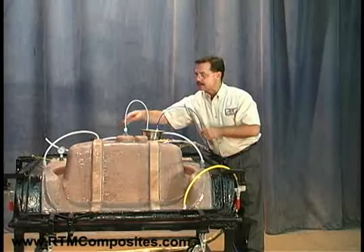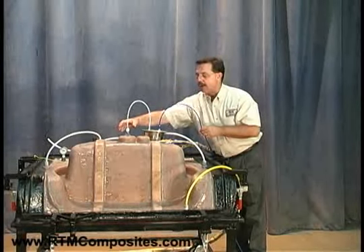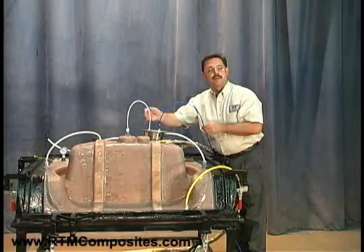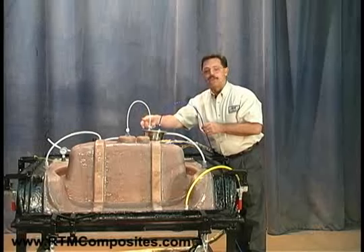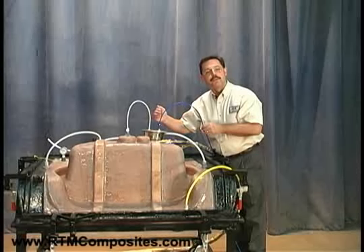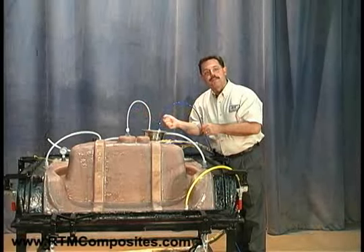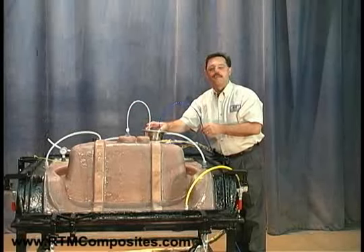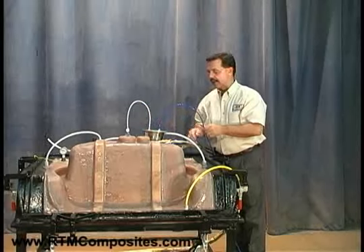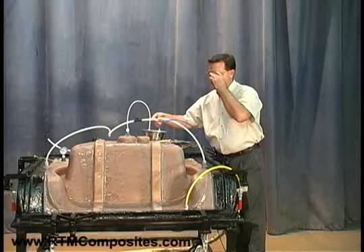Our catch pot will witness resin coming through the vent — this is the end point of the fill, the final place. We're chasing all the resin coming in around the perimeter of the cavity, converging so we can witness it come here. The recipe is set at a few grams greater than needed to fill the mold, so we'll see it flow into the catch pot. This recipe could be refined over multiple trials, pulling a few grams out each time until virtually none is going into the catch pot.